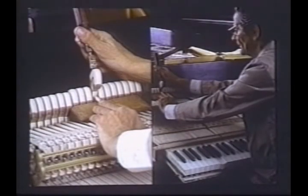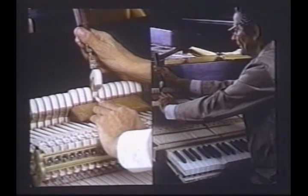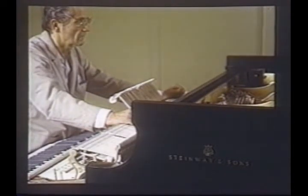The resiliency of each hammer is crucial. Each is tried note by note, and the action is removed and the hammer subjected to a sticking with a 3-needle device to adjust its resiliency. The action is put back and tone tested again. This process is repeated until the entire keyboard is even in tone quality. In expert hands, the Steinway piano is brought to tonal perfection.